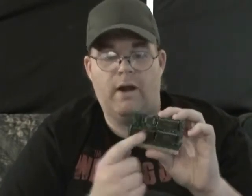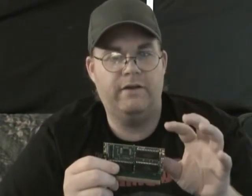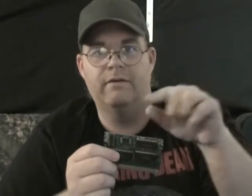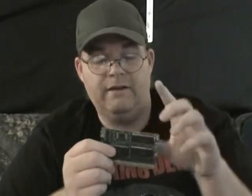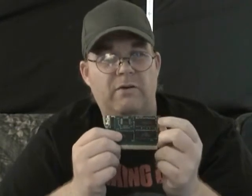When you do a Final Fantasy III, you have to do some funky stuff. You have to pull the character and the program chip, and up here is your W-RAM. When you work with the Final Fantasy III, you also have to build a battery setup, and it's a real pain. Sometimes if this is the wrong W-RAM, you have to swap it out because it'll drain the battery, and there are a lot of problems with batteries draining.